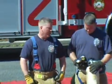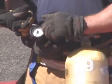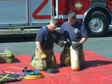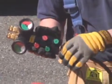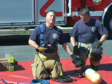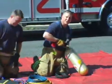Next, we want to set the regulator pressure to 135 psi. We do that by turning the controlling knob clockwise. As we turn, we see the arrow on the low-pressure dial start to come up. Many times we'll put a white or red mark right on the dial itself at 135 to ensure that we have the right pressure. Our next step is to connect the supply hose from the cylinder to the controller. When connecting these hoses, you want to hear the coupling snap and you want to screw down the safety collar. At this point, we would turn the inline valve on the regulator itself to the open position, which supplies the controller with air.